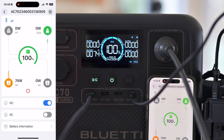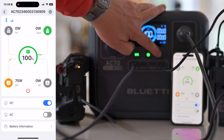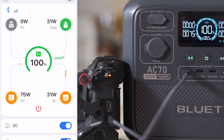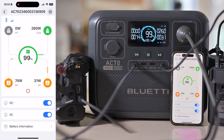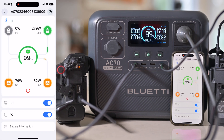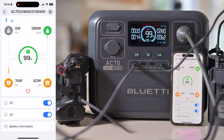Also in this top plug here we have my studio light. So what we've got to do to turn that on is to get the AC going. There's the light. We can see now that both DC and AC power is running. So there we are at 50% on the studio light - we're going to go up to 100%. We've gone from 31 watts to 62 watts on the AC. The battery is now taking 280 watts from the grid in order to equalize what's going on along with trying to charge at the same time.